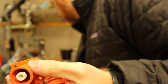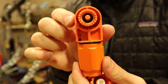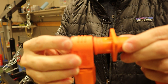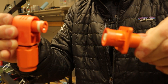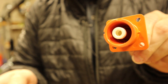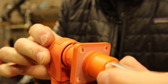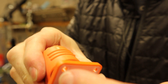Here is a different connector, and you can see that it is not at 90 degrees — it is at 180. There's a little nub there and a little nub there. If you try to plug these two connectors in, it is not going to work because those do not match up. You have to align those keyways. So if you've got the keyways here and you've got the keyways here, when those line up, they will snap together.